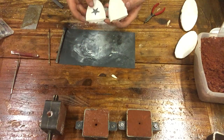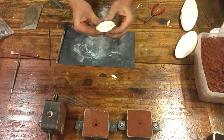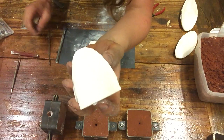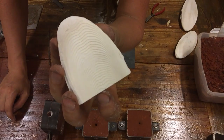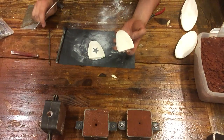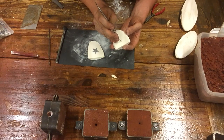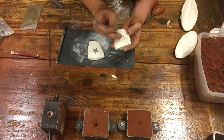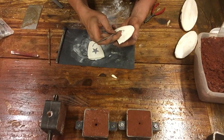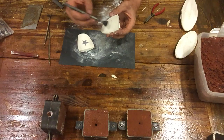I did not press hard enough, so we're going to have to make sure that we line up our tops again and just gently rock it back and forth, trying to keep that registration in place. I'm pushing it back and forth to see if we can capture that star impression. There's a very subtle star that you can see cut into the ribbing, and I'm going to use that to create vents that go straight out in the part at the peaks of the star. Then I'm going to gently brush out that textured region so it seats just a little lower.